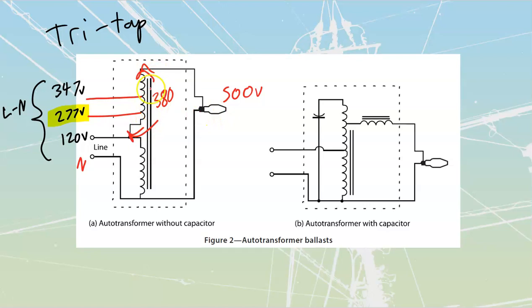That 380 volts, I'm going to be dropping that all over top of these ones over here through the current that goes through. Once again, it's going to be poor power factor that we are going to have. We will have better power factor if we go to something like this. Now, there's a couple of things that are happening inside of here. First of all, this one over here has got a series reactor that has been brought into this one as well. Secondly, the drawing is screwed for some reason. I don't know why it's been moved to where it is right now inside of here.